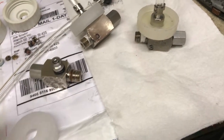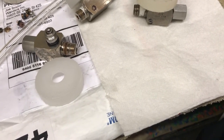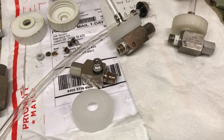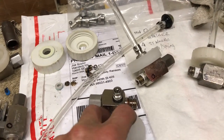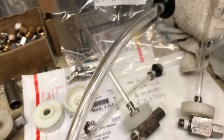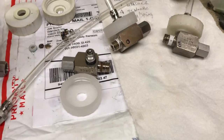You get the Wanders injection sprayer, you get the Wanders repairs, you get this cap — it's the only cap I sell. I actually learned this from one of the guys on Facebook who complained he couldn't get his cap to turn to screw onto the jug — that's when I first realized these caps don't always work. All five of these are working now. All I had to do was change out the nozzle bushing to stainless, give a fresh draw tube, and in several cases give a new cap — and he's back in business. I'm most proud of this DEMA because I bet he would have never got it to work, and all it needed was a fresh draw tube.